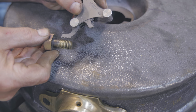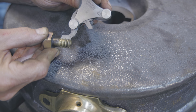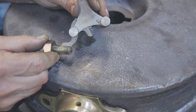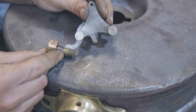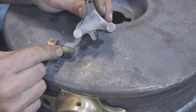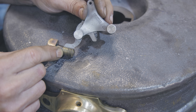Just a close-up here — you can see the 12 threads per inch on the thread pitch gauge. I'll also note, I've had a lot of people comment about Whitworth threads, which was an English standard back at the time period this was made, which instead of using a 60-degree included angle on threads used 55 degrees. But looking at the thread form in the thread pitch gauge with a 60-degree gauge, it looks like it matches. I feel like we'll be fine just using a regular standard 60-degree tap — pretty sure these will fit just fine.